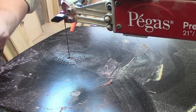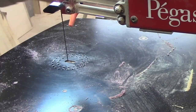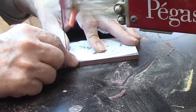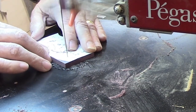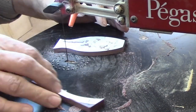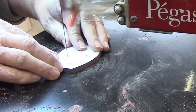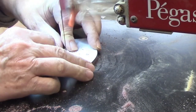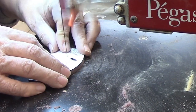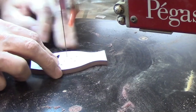The cutout from the middle section is what creates the interior portion of the vase. I usually make all the interior cuts first on pieces that have them, but that wasn't necessary on this piece because those few small interior cuts weren't going to greatly weaken the workpiece. I had already drilled the pilot holes for the interior cuts, so on the leaf shape I cut from the pilot hole to a corner, then backed up to the pilot hole and made a cut down to the other side of the leaf to that same point. This is an easy way to make sure you have nice sharp points where they're needed.